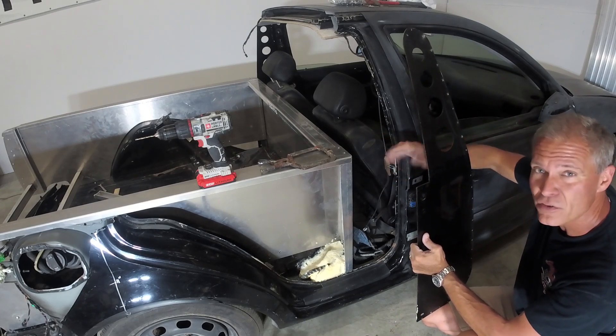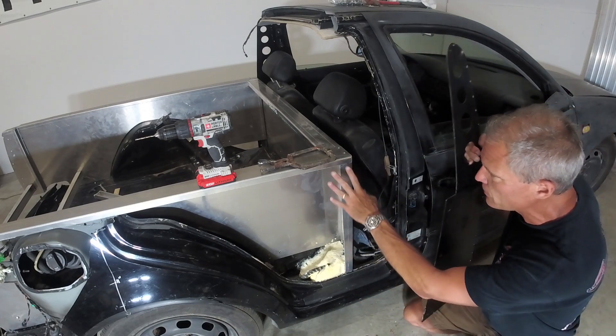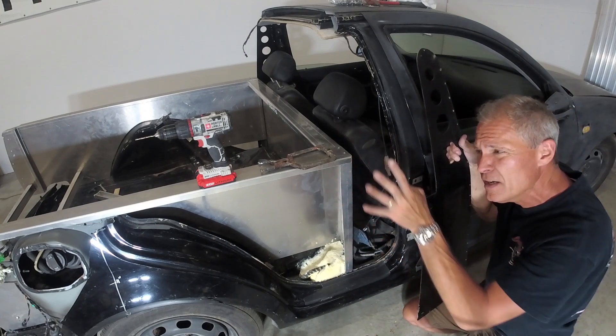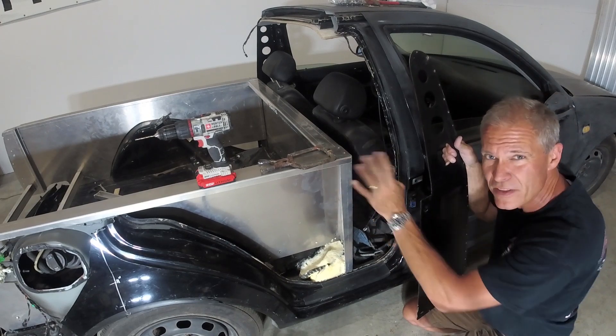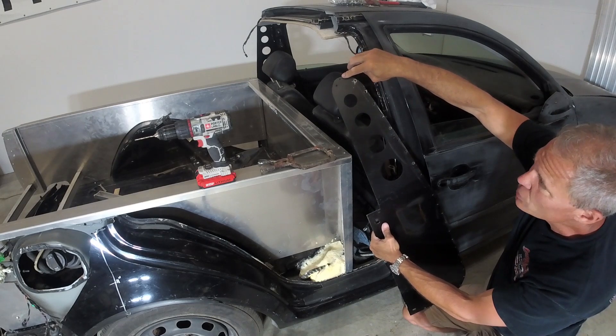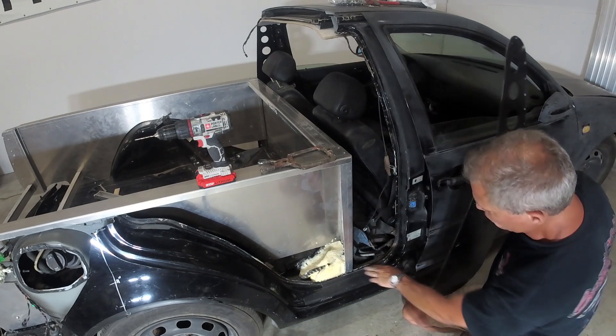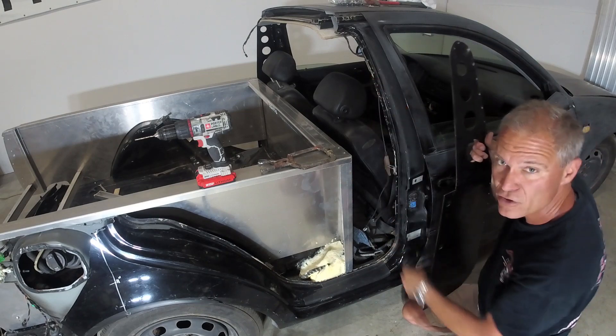So this is the trick as far as making the car one piece. We pre-assembled the bed in the last installment, so we're going to be able to — remember this is still loosely fit, nothing is really tightened down. You're basically going to fit this leading edge and this curved edge down at the bottom into the curved edge and the leading edge of the B-pillar.